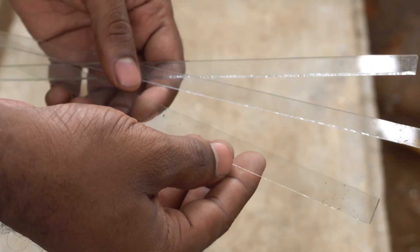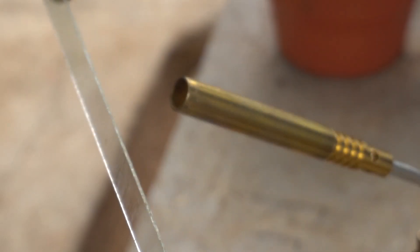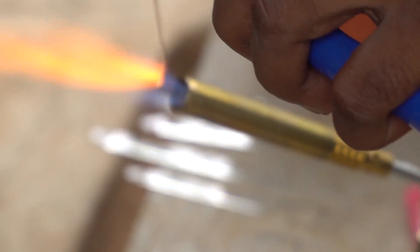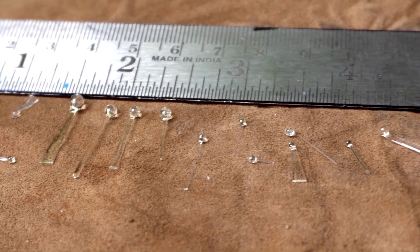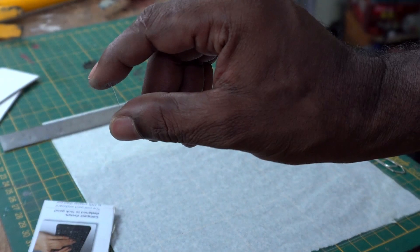I will have to do a little bit of more talking in this video — it is essential, so you will have to bear with me and my English. Let me run you through the process of how I made the Leeuwenhoek microscope. I acquired some glass pieces pre-cut to 10 mm by 300 mm and heated them on a high flame with a butane torch. As the glass began to melt, the two ends were pulled apart leaving two glass whiskers on either side. By reintroducing these whiskers back into the flame, they curl up to become tiny glass beads. Once cooled down and broken away from the main glass thread, they resemble a tiny spherical glass lollipop. The bead needs to be round and the diameter has to be around 1 mm for best results. By making a pinhole on the cardboard and placing this glass bead, the microscope is ready to be used.